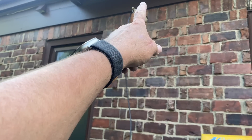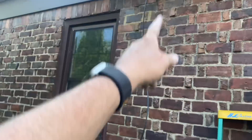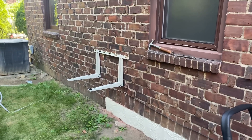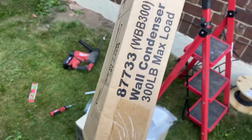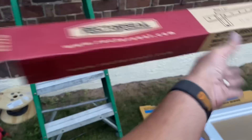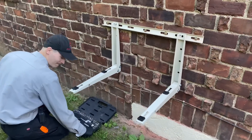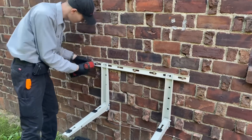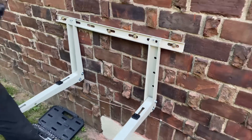To meet the minimum line set distance of 11 feet, we have about six feet and then five — a little more than six, around eight, and around seven on the other side, so we're good. I got the Rectorseal wall condenser bracket, the 87-733 — so much better than the garbage from Diversitech. It comes assembled. One, two, three, four bolts to anchor to the brick. We had to chop away a little bit of it to get that flush, but looks like we'll be good to go.